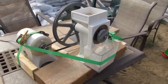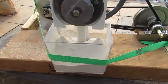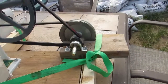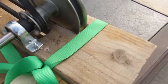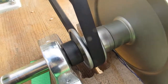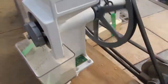So it's been running for a little while — I'd guess probably about 40 minutes. I have encountered a few things. One, the vibrations make the canister fall off, so I just tied a toe strap around it. Two, the rubber belts being brand new have some bits that have come off, so I'm glad that's nowhere near the food. And three, the drive shaft, not being a real drive shaft, doesn't have a square peg to keep things from twisting. Because of that, the smaller pulley broke loose twice, so I had to tighten down both set screws as tight as I could, and it's been alright since, but it was a bit of a nuisance.